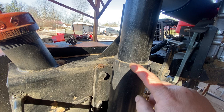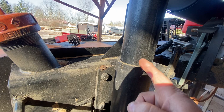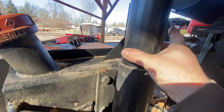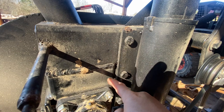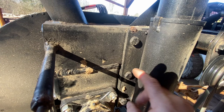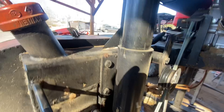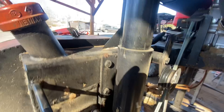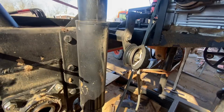This makes up the difference between the two pipes. This little flange we machined on the plastic with our lathe just keeps it in, and we also cut a slit in the plastic so that we could squeeze it over the top and slide it down in, then remove it if need be — it gives us the ability to open the plastic up. You can see how this tube is welded to quarter inch plates and this whole system is tapped, so these six bolts give us the ability for this head to move up and down for slight adjustments. We also have the adjustment right here from our chain drive system to raise or lower this head to make it parallel with the bed.